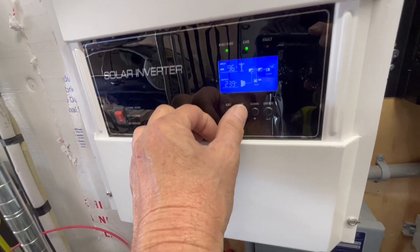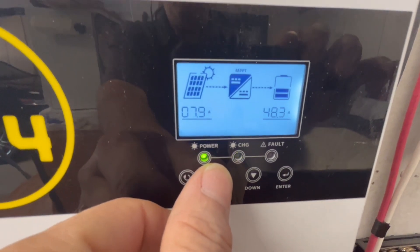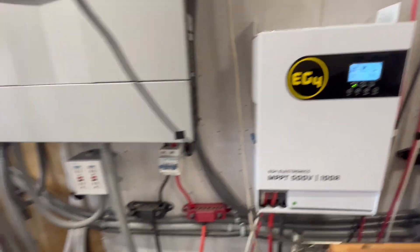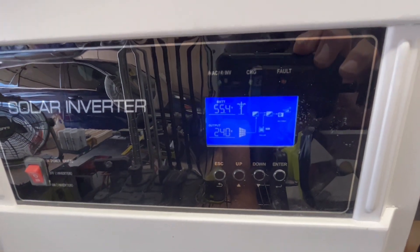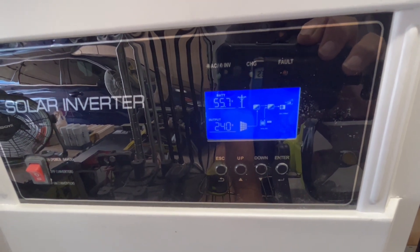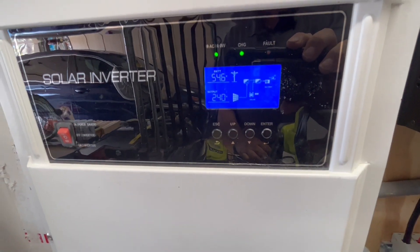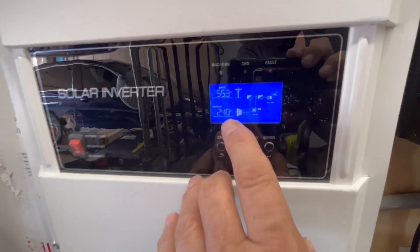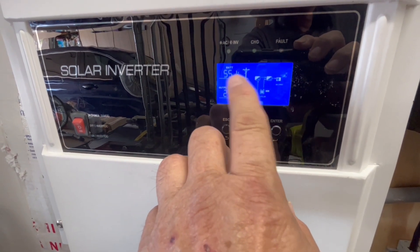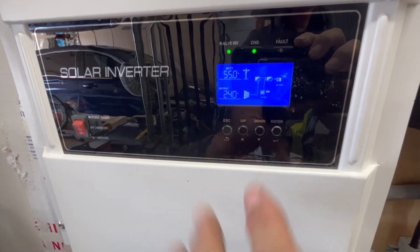It was really rocking yesterday — we're at 96 amps on this plus the other charge controller over there. It keeps going up and down depending on those clouds, but it's not dropping below 52 volts. At the end of the day it's still at full charge. I finally got that pool heater to where I can run it all day long. I can start this up at like 8 o'clock in the morning and it'll be grid assist back and forth — maybe 20 seconds grid assist, 20 seconds just solar, then switch over to grid. And it's seamless; it doesn't shut down my pool heater.